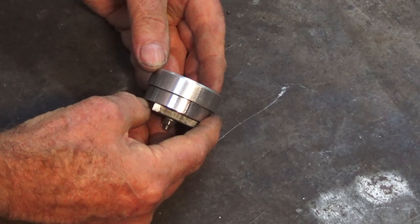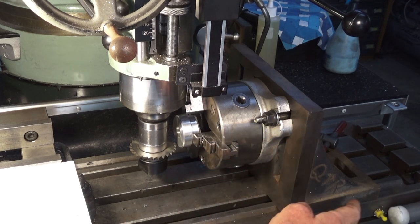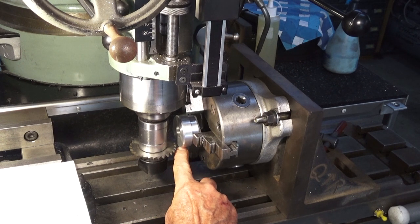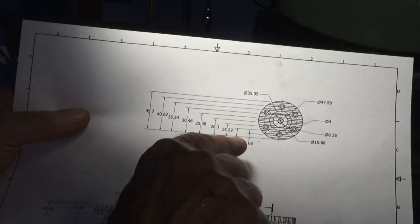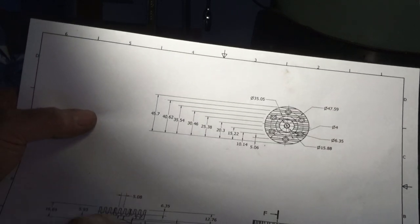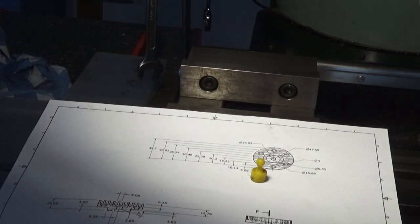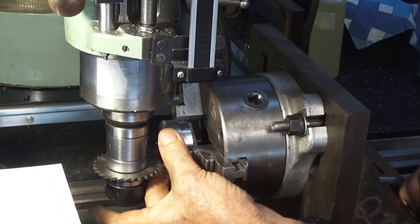Let's get this set up in the mill and have a look at how that's going to work. I've got a three-jaw chuck bolted to a large angle plate. The angle plate is aligned with the Y axis, and I've already offset from the bottom of the cylinder head blank to the height of my first cut. I'm going to be using the micrometer dial on the Z axis and the DRO, and I've got a drawing showing all the offsets from the bottom of that cylinder head blank. As long as I stick to these numbers and run each pass it should be correct. But if you get this wrong, the thickness of the first and last fin will be different and it's going to look stupid. So in a state of high anxiety I've been through this and rehearsed it a number of times.